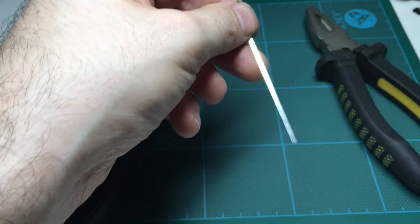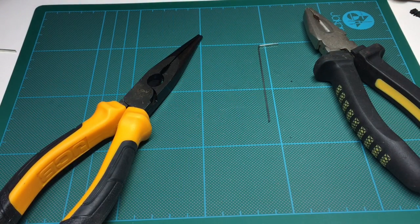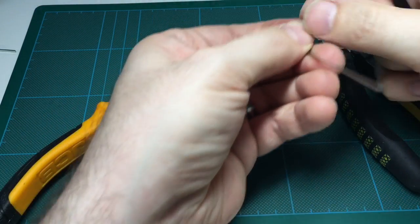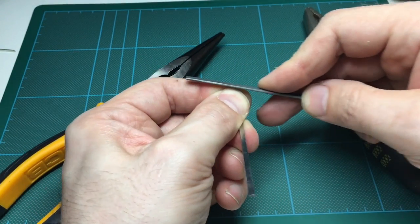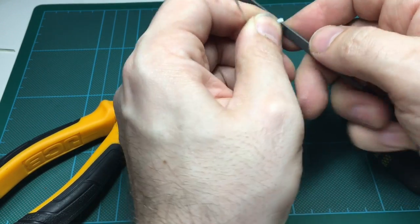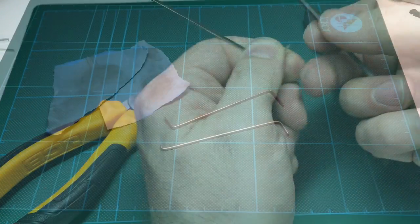How do I get rid of the rough edges? Well, you can sand them down all you want. You can also just take a finger file and some time, and I'll just go along with a finger file in a vise and take off those edges.